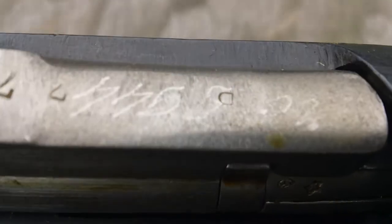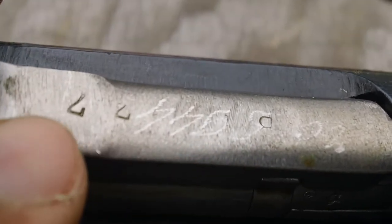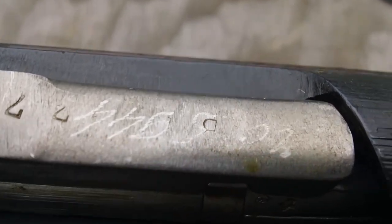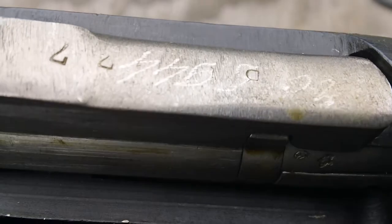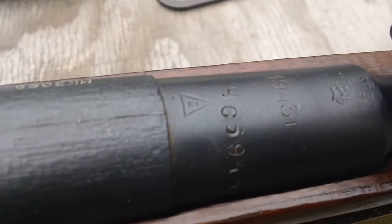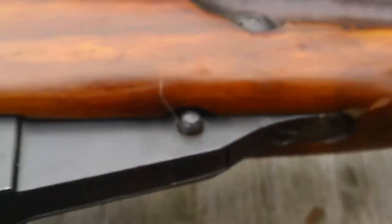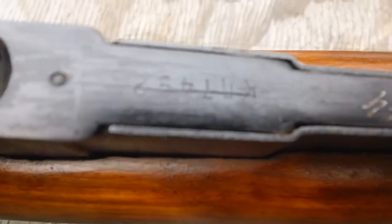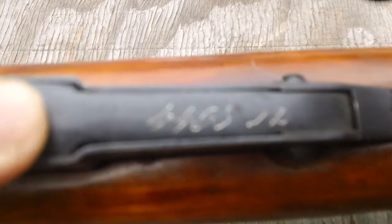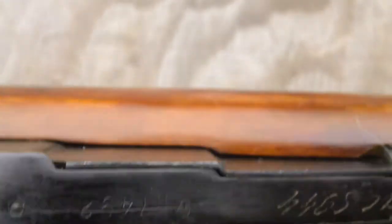On this particular refurb, the serial numbers have been electro-penciled or engraved. You can see some of the old number that they ground off from whatever rifle this originally was on, and it was renumbered with an electro pencil. This was probably done later on in the refurb program that ran about 40 years. Those numbers were made to match the original barrel serial number. On the bottom, there's a number that's been lined out — they didn't even bother to grind it off, just EP'd a new number right next to it. That's called a line-out.